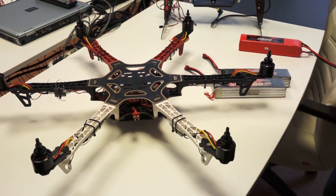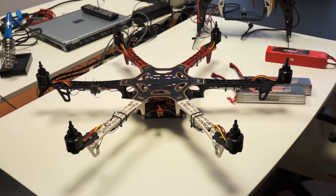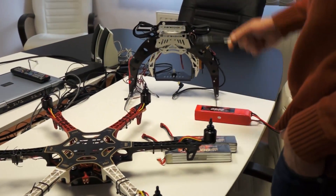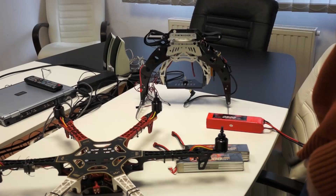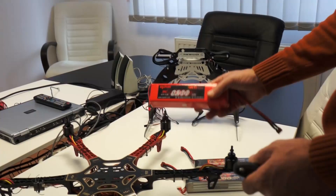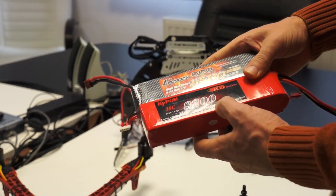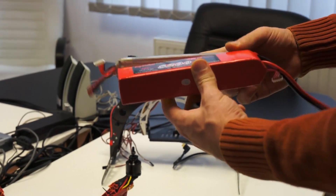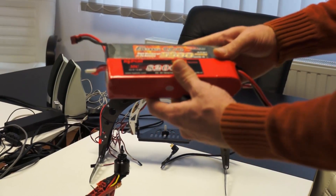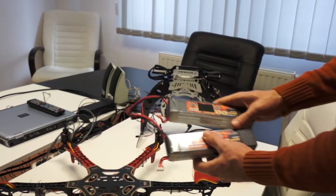So the conclusion is that you can fly this upgraded F-550, but with not too much weight on it. You can fly it with the AV-130, but you should give up the idea of using the battery tray. You can fly it with one battery — maybe use a bigger one. This one is an 8.2 amp battery and it's not that much extra weight, but if you use two of them they are just too heavy.